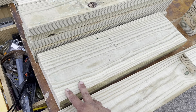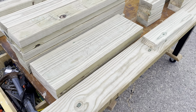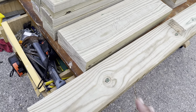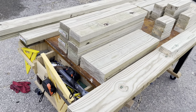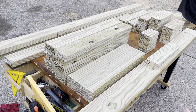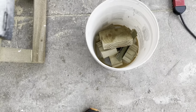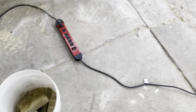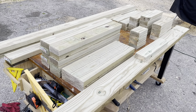We're only going to use four feet of the 2x8, so you'll have four feet left over — you can get two gliders out of one 2x8 stick. We also need one 2x6 that is 71 inches long. The plans are ten dollars on our Facebook page, and one key benefit is very minimal waste. This bucket was empty when I started — that's all the scrap you get when using the optimized cut list. We take the time to figure out how best to lay all the parts out on the boards.